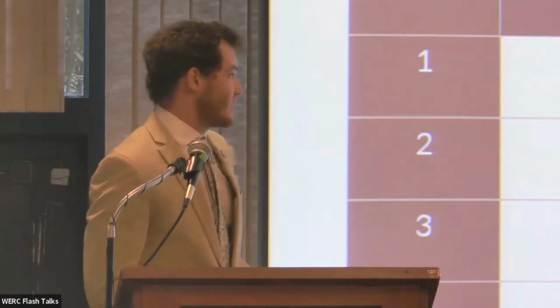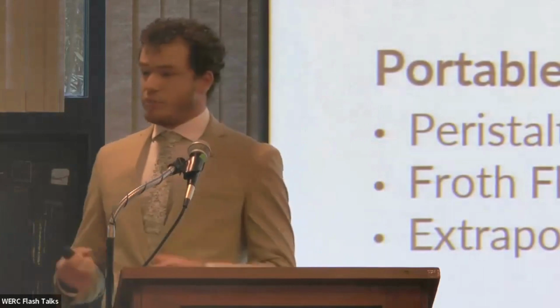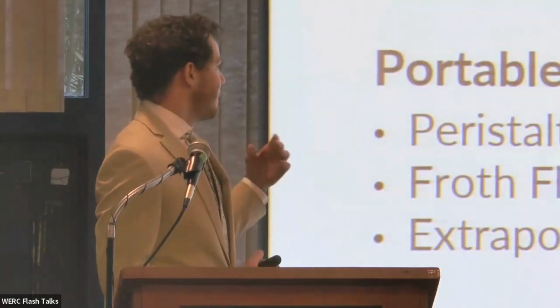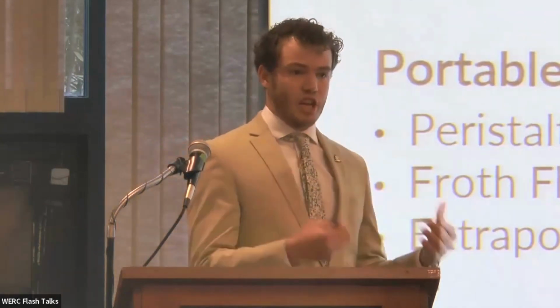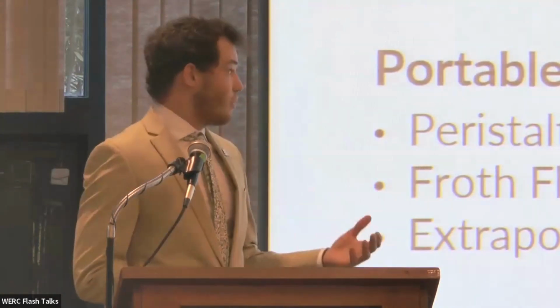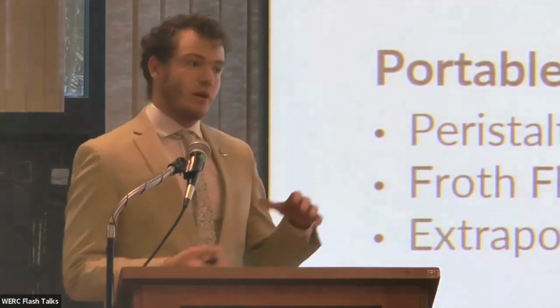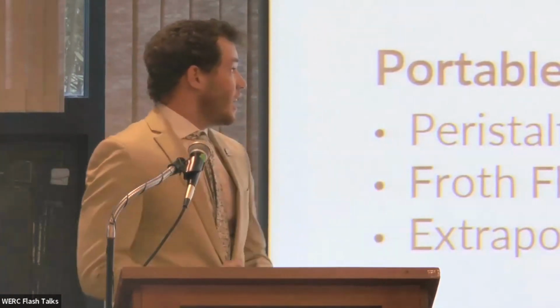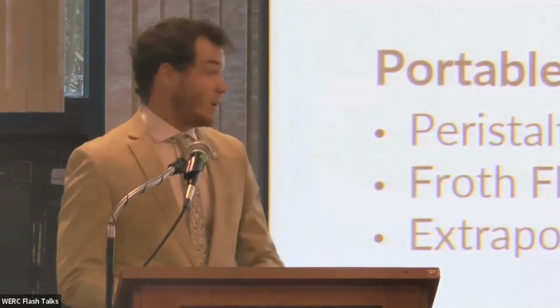of microplastics in water. For this to be utilized on a small watercraft, a peristaltic pump needs to be utilized. This is because the microplastics live in the metalimnion depth due to the change of temperature of every 1 degree Celsius per meter. Therefore, the peristaltic pump will be used to pump it from that depth onto the boat to do the sampling. Next, the device will be in a portable kit, which will allow for a user-friendly experience.